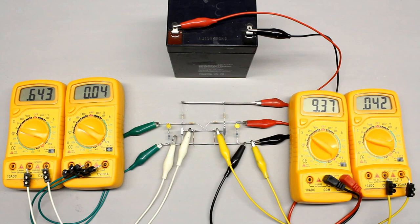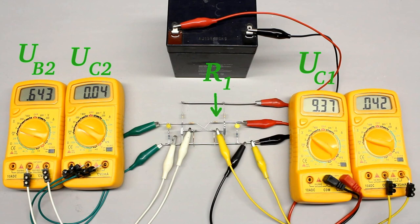At the initial state, the right transistor is turned off and almost the supply voltage can be detected at the corresponding output clamp, so the right LED is illuminated. The base of the left transistor is connected to the collector of the right one via series resistor R1, so we can detect a voltage drop of approximately 0.6V. The left transistor is turned on, the voltage drop at the emitter-collector line is almost zero, hence the left LED is not illuminated. The potential at the base of the right transistor is pulled to nearly ground by series resistor R2, hence that device is turned off by the left transistor.